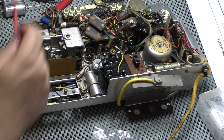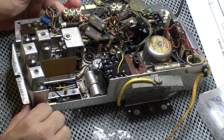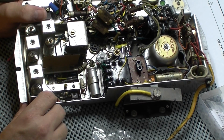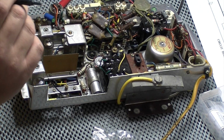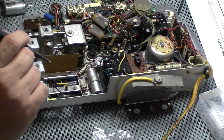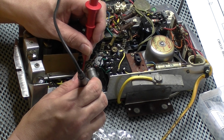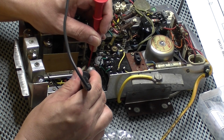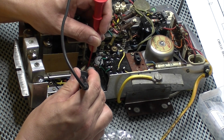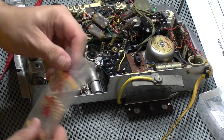Okay, I'm just quickly checking these resistors, these 2 here, because they're right in that LT circuit. I want to make sure that these are correct. Now the gold band I believe is 5% tolerance, so they need to be 10.5 ohms maximum. They're 10 ohm resistors. So that's reading 12.8, that one, but it's reading 12.3. Just wondering whether that's because they've got some wire in them.